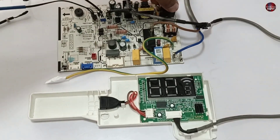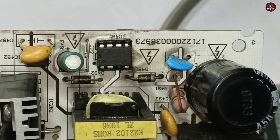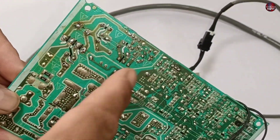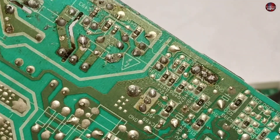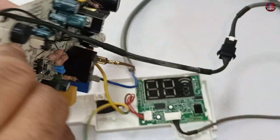Some other tech person has worked on it and tried to repair it. Let me show you the motherboard closely. This switching IC in this motherboard has been replaced. A lot of work has been done on the back side of this motherboard. The soldering work has been done on this area on the back side. I think he thought that this area of the motherboard had been faulty, but the problem is not over here.